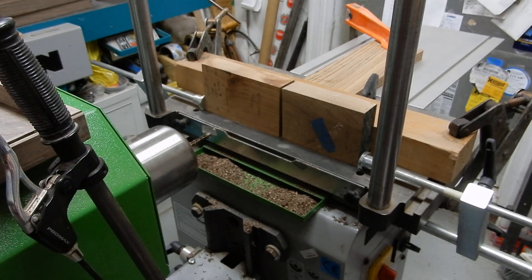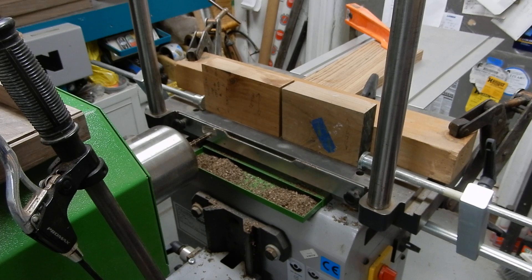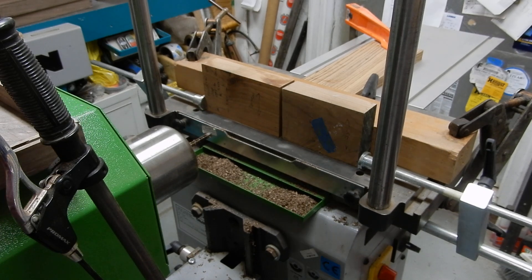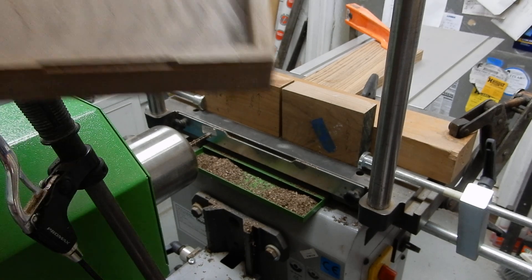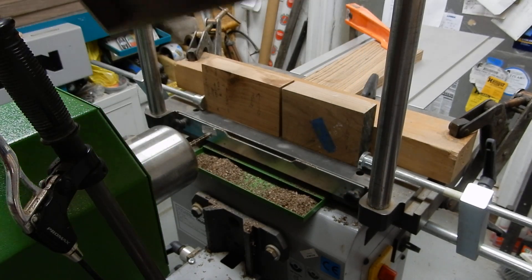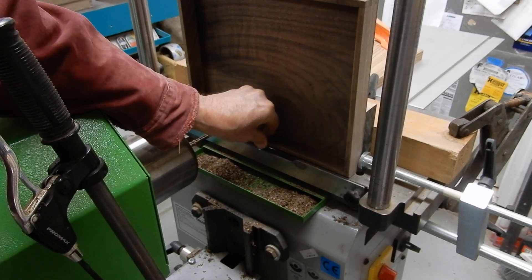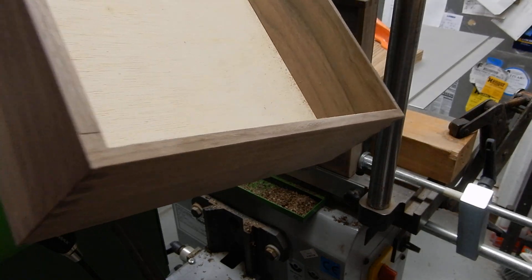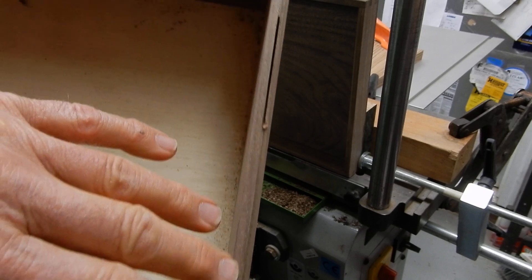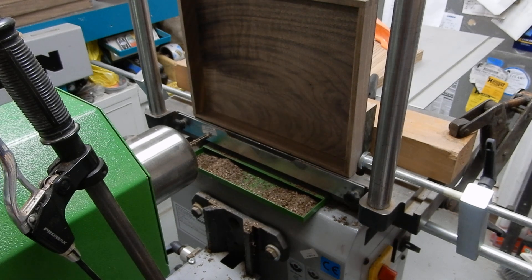I'll show you the steps I go through in getting the square chisel hole in there. I'll turn on the electricity to this machine. This is a rather small hollow chisel square hole, and after I'm through I'll show you the final result. I'm going to place this in the jig that holds it steady in the same position for this lid piece as it would be for the walled box. This particular box has two corresponding slots for the two hinges that join the box walls to the lid.